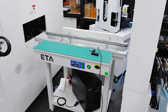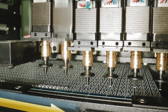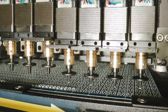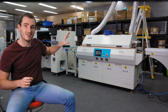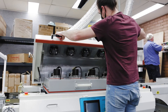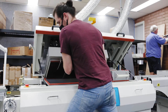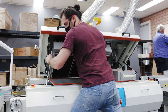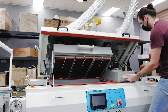From the stenciling machine we move along an upgraded conveyor into the pick and place machine. The components get placed and then from the pick and place machine along another new conveyor into our T4 reflow oven. It's nearly two meters long and it has four heating zones each on the top and bottom — so that's eight zones total.